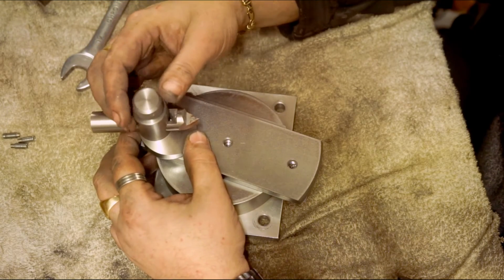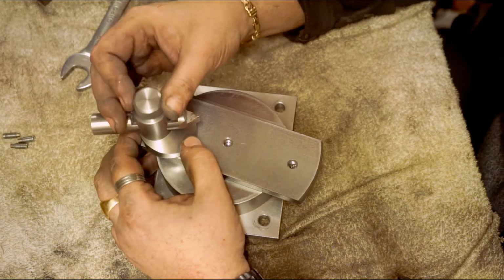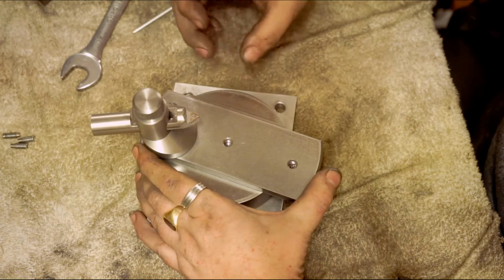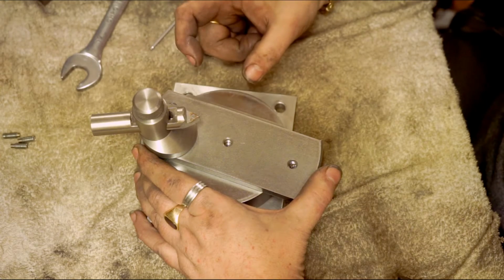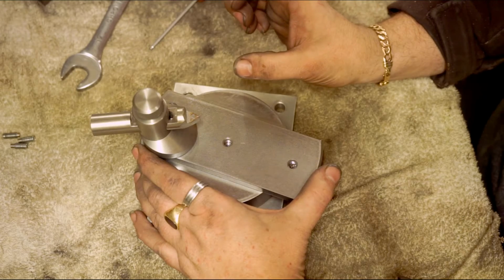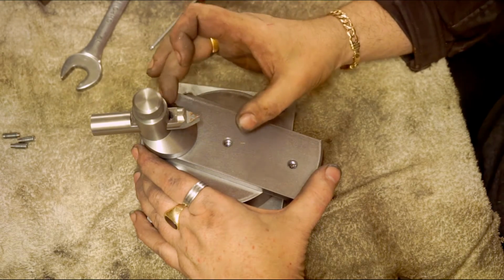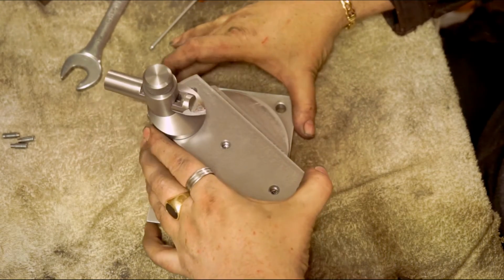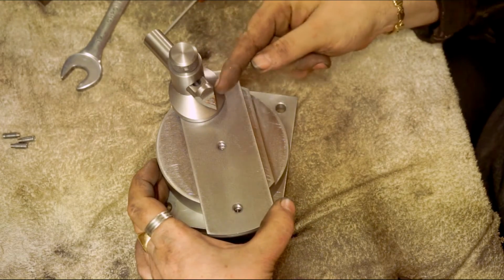And turn like that. And like I say, it doesn't have to be perfectly on centre. So that when you've got the work here and you've got a spinning chuck, you've got the stub of the main part of the steel that's sticking out of the jaws of the chuck, or the collet chuck, and you've got the recess, and then you want to turn the ball. You'd have it set off to the side a little bit at an angle so you can get more round behind the ball before this touches the chuck.